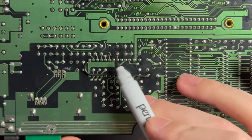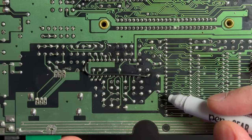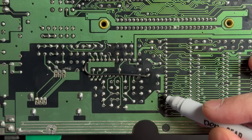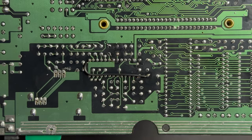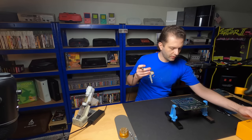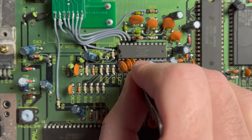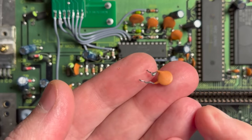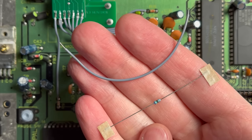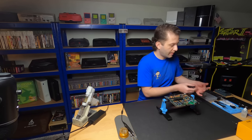I've marked the legs of the capacitor I need to remove. Pin 6 on the Z80 has an alternate via right here, so instead of soldering to pin 6 directly I'll solder my wire to this via. I'm going to use the fiberglass pen to expose a little bit of copper. Let's extract that capacitor. I have my jumper wire and a 75-ohm resistor. I'm not going to worry about making everything look great right now because if it doesn't work I'll just put it back the way it was. Let's anchor this wire in, we have one leg of the resistor up here, flip the board over and anchor these together.